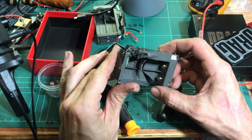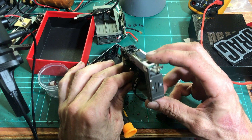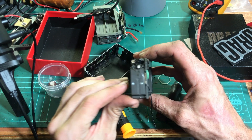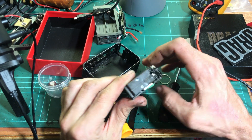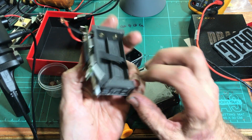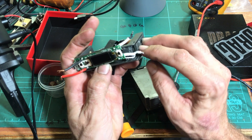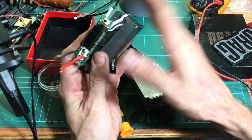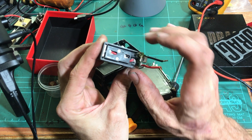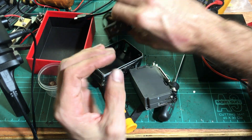It's kind of not looking like there's any major wiring faults — nothing that's fallen apart, not like a cell contact has come apart and touched the case metal or anything. There are two carriers, top and bottom, for the contacts — only the top contacts are sprung with two little springs under there. This carrier just holds it all together, holds the contacts in place and holds the spring against them. On the bottom, these are just solid contacts, but again you've got another little removable frame to keep everything in place. That all looks fine. There's heat there, but there would be heat if the board just failed and shorted in a big way — it's going to draw a lot of current from the cells and these are naturally going to get hot anyway.